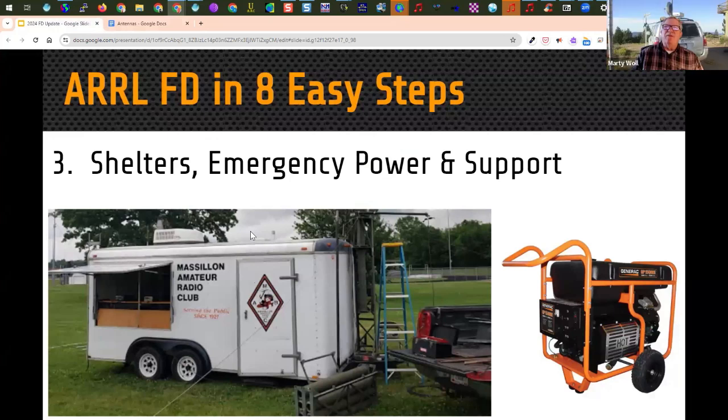Yeah, the thing to remember, if you're trying to make a decision between high gain complex and low gain simple, is that everything radiates and you will make contacts, whichever way you go. It may be more of a slog in some cases if you have a very simple or very low antenna, but putting up the bigger stuff, which we've done plenty of over the years, multiple Yagis and everything else, takes time and effort and manpower. And if those are in short supply, don't get so ambitious that you wear everybody out before Field Day starts.